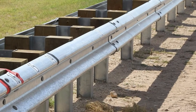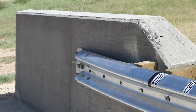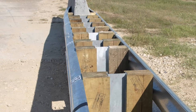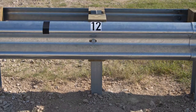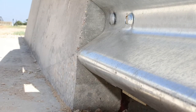The double-sided guardrail is much cheaper to install than concrete barriers. Districts might not have the funds to install concrete all the way down, but they might have enough funds to install double-sided guardrail. Also, double-sided guardrail allows for drainage underneath, which concrete barriers do not allow for enough. This project allows us to make that choice and to make the best choice for the public.